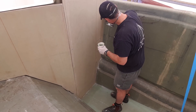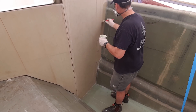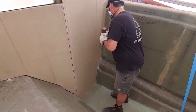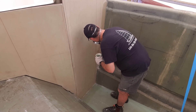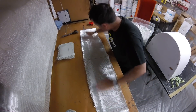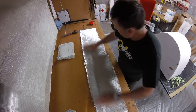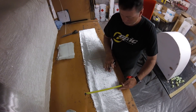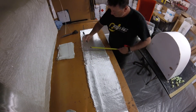All of my tabbing is done with vinyl ester resin. I use vinyl ester because it gives me a quick setup time. Within one or two hours I can go back, remove the peel ply, and add more tabbing if I need to — add composite angle or whatever. Whereas with epoxy I'd have to wait around 24 hours. So it does speed up my time, and working on my own, I find that really advantageous.